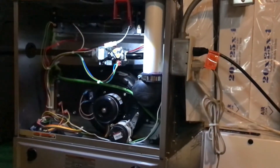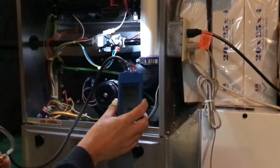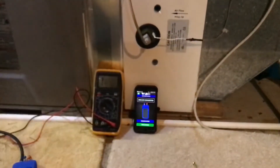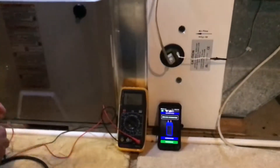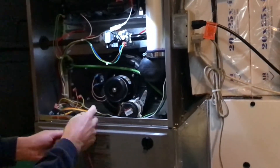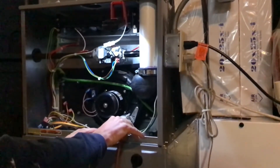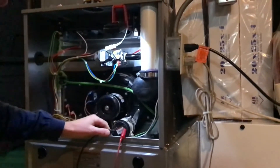The way we're going to test it today is we're going to use the AAB SPM100 manometer, which Bluetooth connects to an app you download on your phone, and we're going to use our multimeter. To keep the furnace running we've disconnected from the board and we're going to check the high heat — put our multimeter on there.